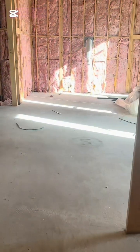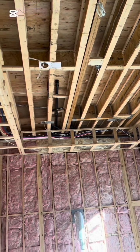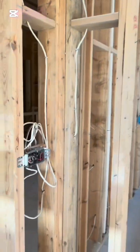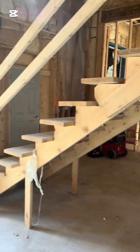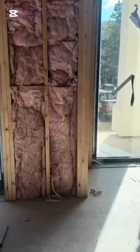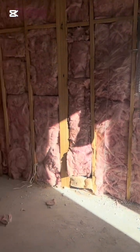As we go into this room here, same thing — my receptacles have no box on them because they're going to be coming out of the baseboard. That's where the receptacle is going to be placed. And here you're going to have LED strip lights at the top. My switches are neatly supported on both sides according to code. There's also security wiring here, and there's going to be a heater here as well.